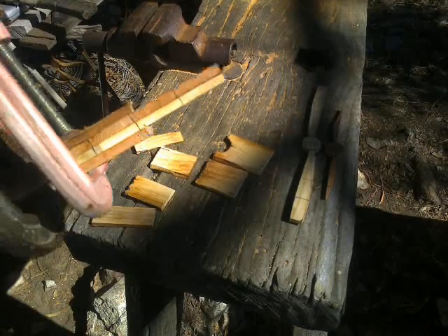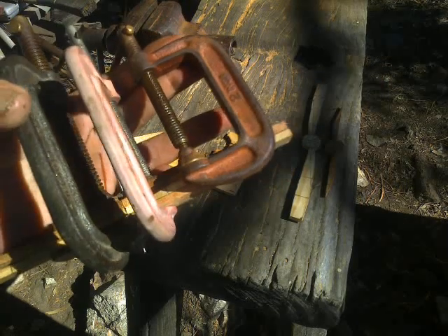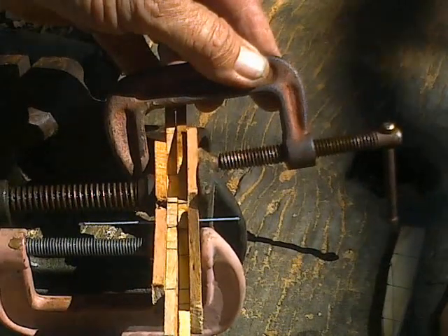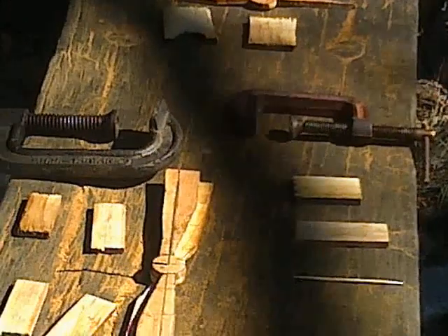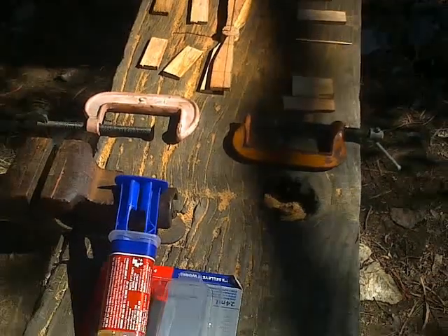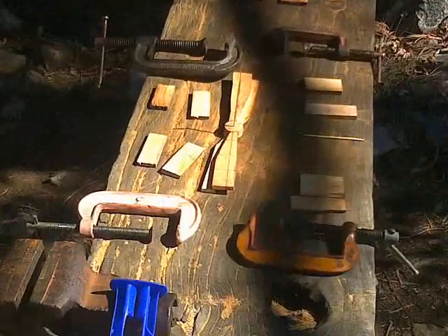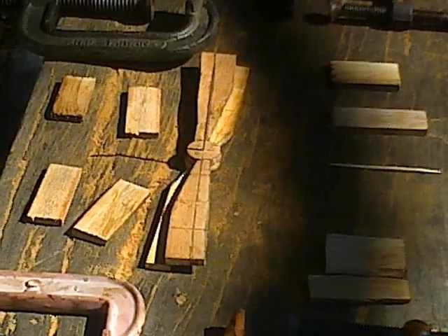You also have to count your packing blocks and make sure you've got enough of them, because once you mix the glue it's all got to happen. You have to pre-open your clamps for the right dimensions, just to save yourself a little bit of time when the glue is going off. At about this time, there are five hours worth of work going into preparing the laminae and getting them to the point where they're ready to be glued together.